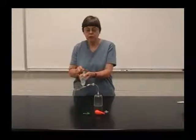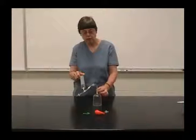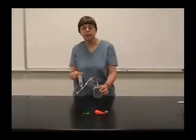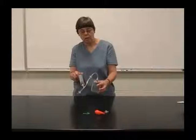So when we do this repeatedly, we keep pumping air from the vacuum jar out to the atmosphere. As you pump air out, that decreases the pressure inside the vacuum jar, and that's why the bottom stays on.